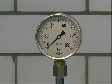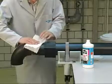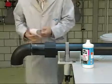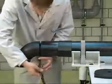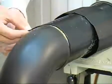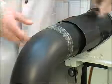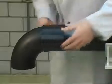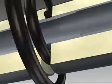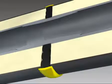After successfully completing the pressure test, the inspection gaps must be closed. Clean the outer PE coat where the shrink sleeve is to be applied with Tangit PE/PP cleaner. Wrap the gap filler into the gap between the CoolFit components, taking care that the gap is completely filled. Apply the hot melt tape around the complete circumference of the gap. Place the shrink sleeve over the middle of the gap and press it onto the tape on opposing sides. The 3D animation shows the separate steps: wrapping the gap filler, applying the hot melt tape, and heating the shrink sleeve.